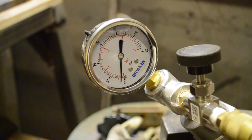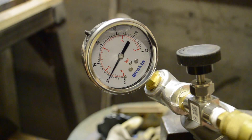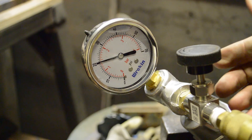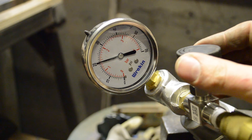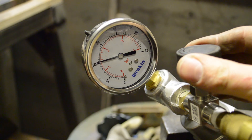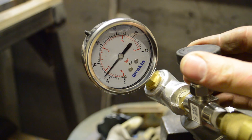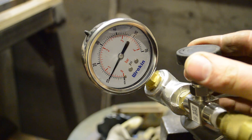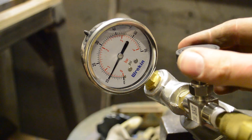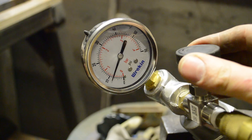Okay guys, I want to show you the difference a needle valve on your burner makes. We're currently sitting at 2 PSI — turn that up to 10 PSI, or up to 20 PSI. Now if I want 19 PSI, there we go — I can adjust this by 1 PSI. That allows you much better fuel economy; you can keep an eye on the exact PSI range that your forge likes to run at. My little forge, before it fell apart, would quite happily tick over at about 5 to 10 PSI. And the needle valve and a gauge allows you to keep an eye on that.